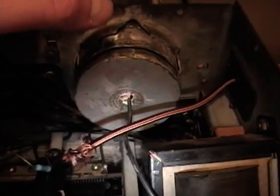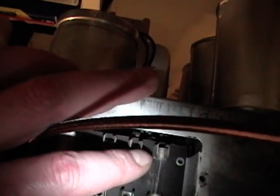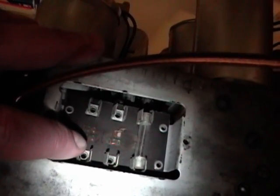Now I need to reinstall this clamp that will hold down the line cord securely, and that will prevent somebody from being able to yank on this cord and rip it out of the other side. Then I need to wire one end to this fuse block down here, and the other end goes to the power switch. This fuse block is a really nice feature — these correspond to taps in the primary for about 100 to 110, 110 to 120, 120 to 130. Since I've got about 122 or so, I went with the highest end. A lot of radios this old were designed for more like 110, and to run them safely you need to use a dropping transformer. I don't have to because I've got that very nice feature.